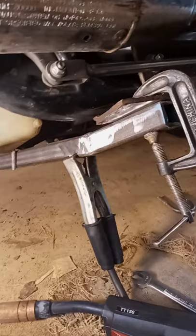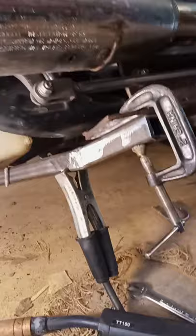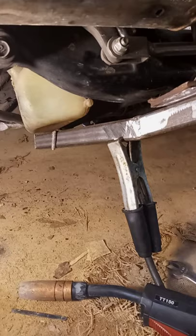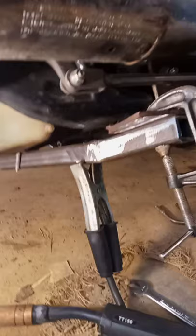I'm about to weld a bottom support bracket onto the bottom side of the angle iron. There's the setup. There's a slight bend I put in it — I cut it almost through, bent it, then welded it back up. That was perfect for getting it back where this clamp's going. Once I get this tack welded in, I can take it off and weld the entire thing up, paint it, and then put it back permanently.